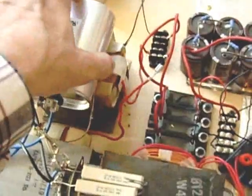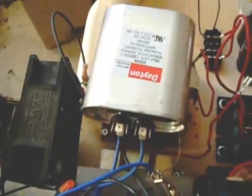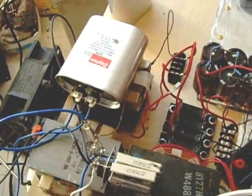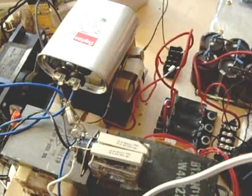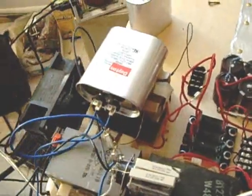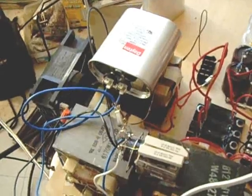Let me explain this capacitor first. It's an AC capacitor, 50 microfarads. These microwave oven transformers exhibit an enormous amount of power factor offset on the power line. And if we put parallel capacitance with this kind of AC capacitor, it'll somewhat counteract that offset and end up drawing less power — about an amp or two less.